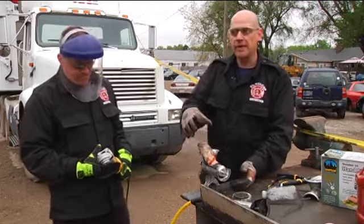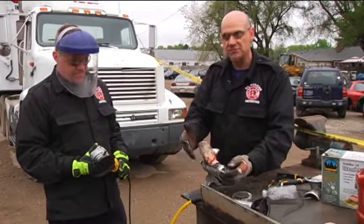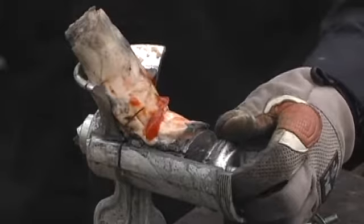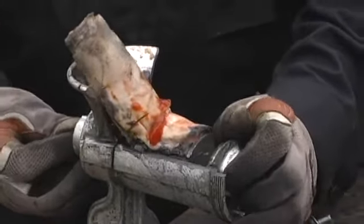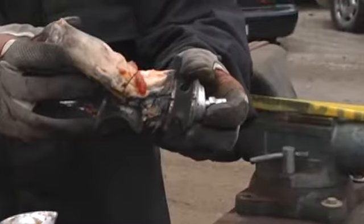Right? Simply pulling their hand out of the machine doesn't do them any good at this point in time. We want to try to take the whole auger assembly if possible. That way the doctors have something to work with. In order to do that, I'm going to release the mechanism off the rear. I have my EMS personnel, my other firefighters holding stabilization, and what we're going to do is basically push the auger mechanism up and out forward. And we can transport such as this.